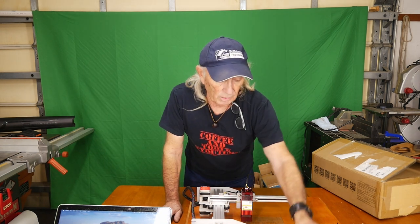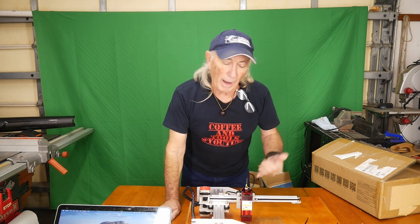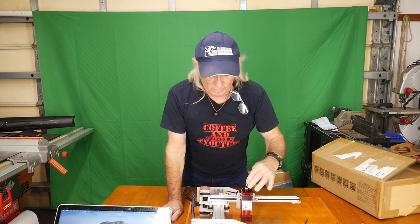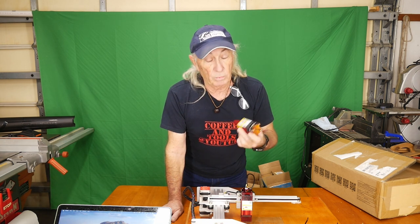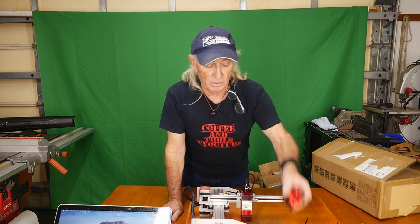I said 15 millimeter earlier — I think it was 5 millimeters of wood cutting for this low power one. The other two are both high power at about 5,500 milliwatts, but the difference between them is the focal length of the laser. That's what makes the difference — one is for engraving hard glass, tile, or ceramics, while the other is for cutting through plywood. I've seen people cutting one-eighth inch wood with them and they do an awesome job. The accuracy and precision from a laser is just what it is — it's pretty damn awesome.